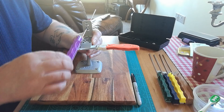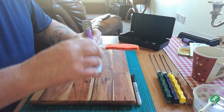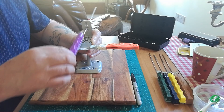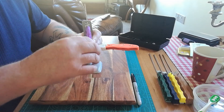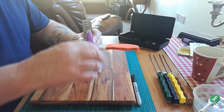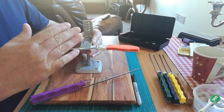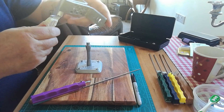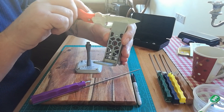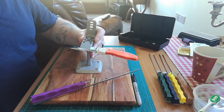All I've got to do now is turn my blade over and do exactly the same thing again on this side. I've still got my Sharpie marker there just to make sure nothing is uneven. Going once up the line — it's removed the Sharpie right down to the edge. I just need to take this bevel off this side. What I want to do is make sure both sides are equidistant — the same bevel sitting at the same distance from the edge up — because I don't want the knife to look out of shape.